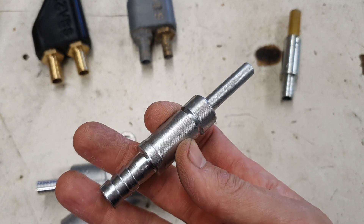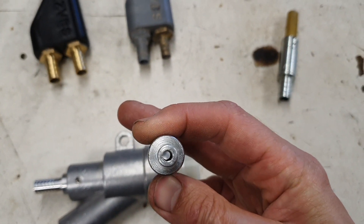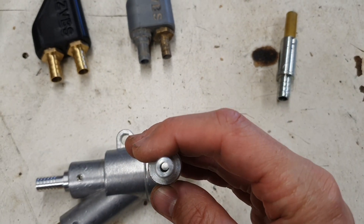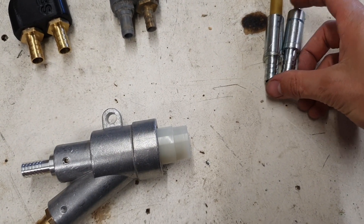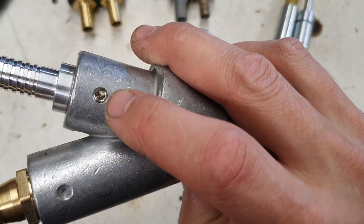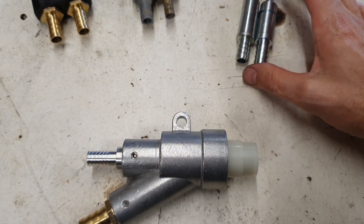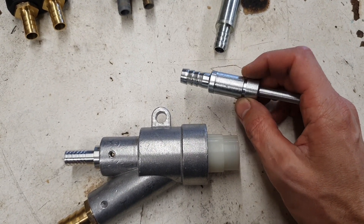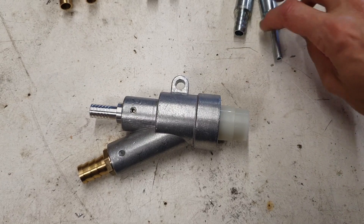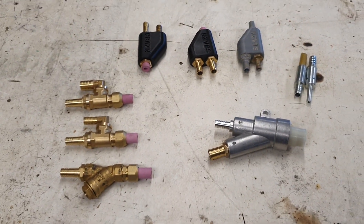It's probably just a happy coincidence, but now if you check yours, you may just be able to improve your gun slightly by putting an o-ring in there to stop it spraying everywhere. Just check that the drill is as straight as possible — they seem to be better, though probably still a little bit large. I've heard of people filing them off and re-drilling them with decent results. If you can, I'd still replace the grub screw with a 304 stainless one as those are one of the first things to rust out. But it would be nice to see them actually using stainless and brass hose barbs straight out of the box. Anyway, that's the update — thanks for watching.